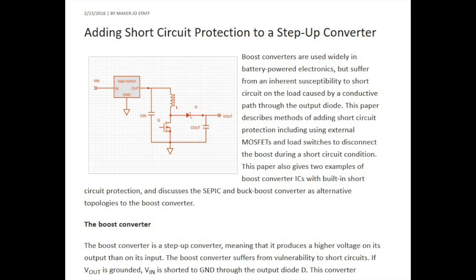I found a good reference on DC to DC boost converters in this paper presented by DigiKey that shows that typical boost converters are subject to short circuits because of their design. It goes on to describe several different strategies for handling a short circuit condition. One way is by specially modifying a boost converter, which would eliminate the need for a PTC. I have provided a link to this paper in the description to this video.